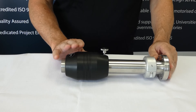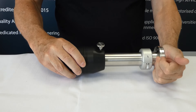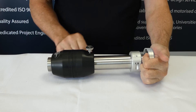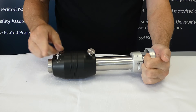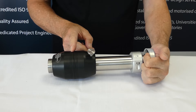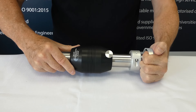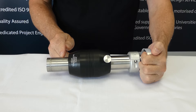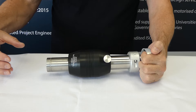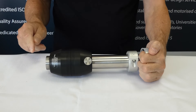The other question we get asked is what sort of force does it take to decouple? If I put my hand on the end and stop the shaft coming out, the magnet will move from its position to the decoupling position which is about 24-25mm. If I push it forward it suddenly decouples at about 24mm. The force required to decouple it is about 14 pounds of force. Recouple it and it is back to 12mm on the back.